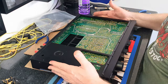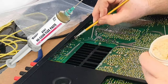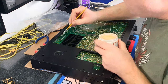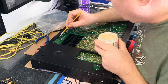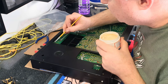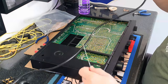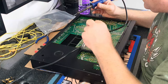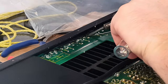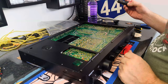Having put the screws back into the phono blocks across the back panel to hold them in place, turn your amplifier upside down again to get at all the pins. I'm going to brush a little bit of flux on each connection. Remember: when re-soldering, flux is your friend — you almost can't have enough. It will help the solder flow well, particularly on these new pins which haven't been soldered before. Do one last inspection to make sure all the legs are poking through the holes, then with a nice warm iron go along and solder each joint. Put your iron on the joint up against the leg for about half a second before bringing your solder in, allow the solder to melt into the joint, and then lift your iron away vertically.